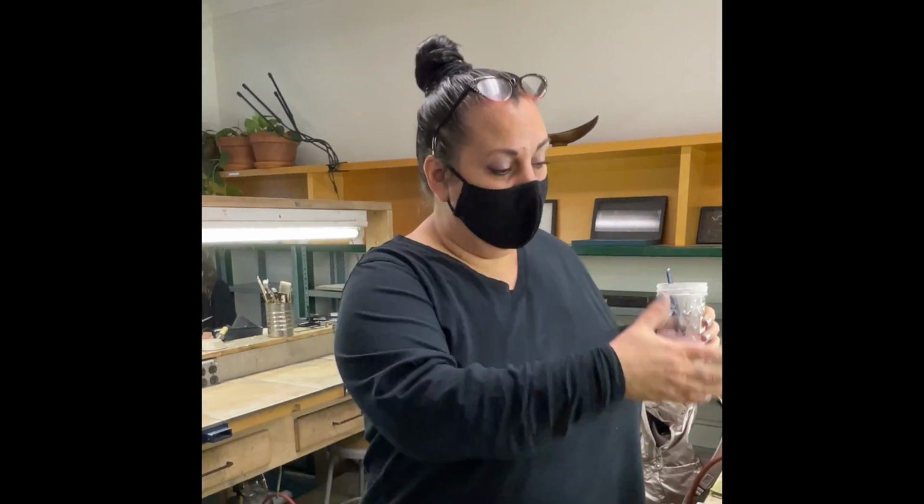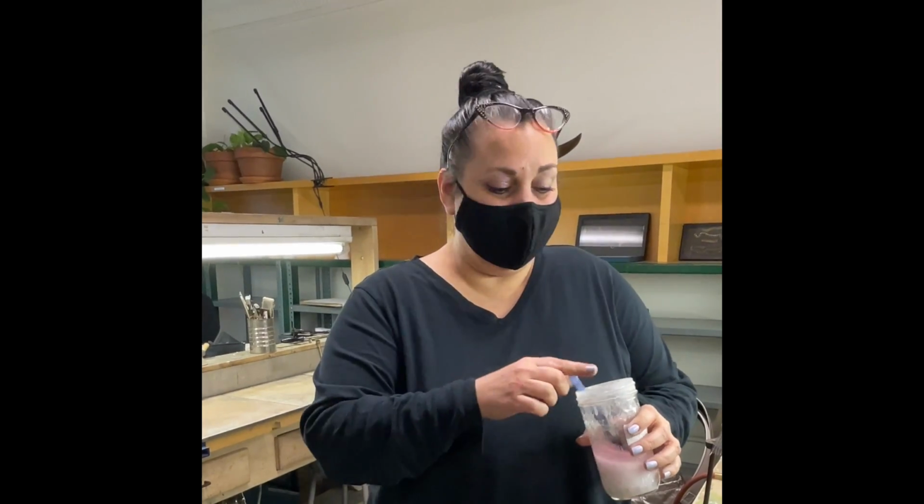And the thing about using these colored alloys is that generally if you're going to anneal or solder, you want to do kind of a fire coat. Because the whole point of them is they have that specific color, right? So if you heat them up without any coating and pickle them, they'll get more and more yellow as more and more of the pure gold is at the surface. Now, is that the end of the world? No, but you want to sand that off to get the original color back. So usually what I do to prevent having to do lots of sanding is I just do the fire coat.